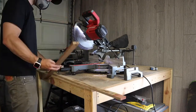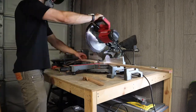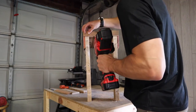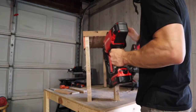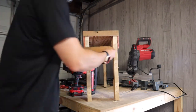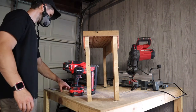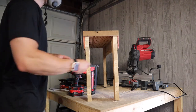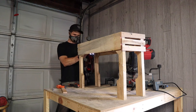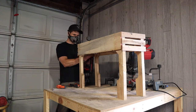Now that you have your legs finished, I'm just cutting some strips for the side of this rustic bench. I went ahead and used a pallet board for the front and the back, and then I'm going to use these strips for the side, which you'll see me connect here with some brad nails in just a moment. So finally we have our bench here — I used one of the pallet boards for the front and the back, and then those little strips with some spacers in between them on the sides.